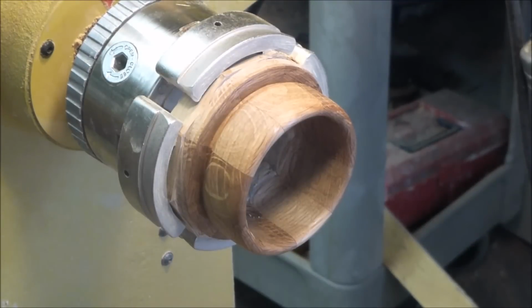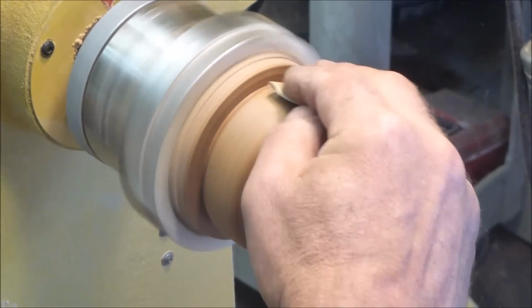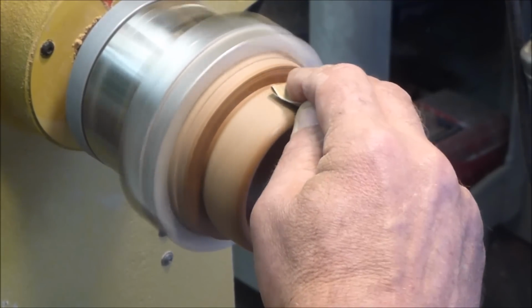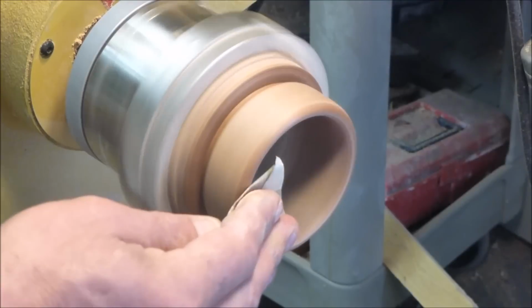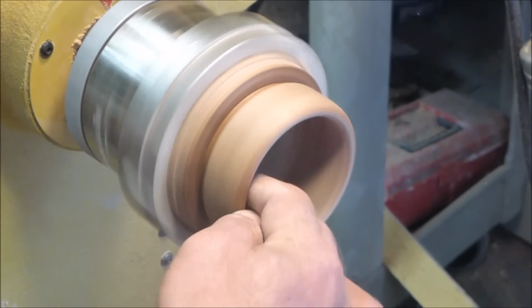I'm not going to wet sand this with oil because I want the epoxy to not compete or have a hard time sticking to this. And if I use any oil to wet sand it, the epoxy may not want to stick very well. So I'm just going to dry sand this down a hair. I don't have to do much because it's just a real thin coat of sanding sealer. Sand this down a little bit,